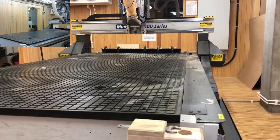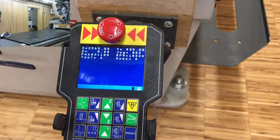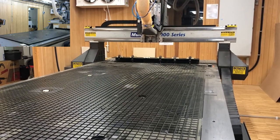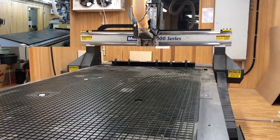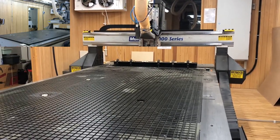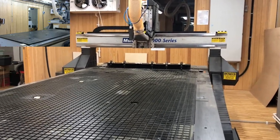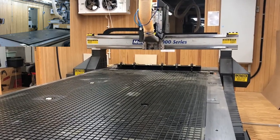When the warm-up is complete, the spindle will be turned off, and you will see that you have returned to the main interface. Currently, the tool in use is still the tool used for the recently finished warm-up, and since we want to calibrate tools 1 through 3, we can optionally return tool number 4 to its tool holder at this stage.